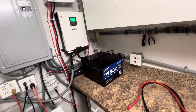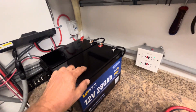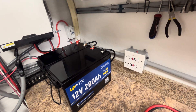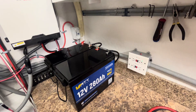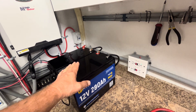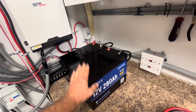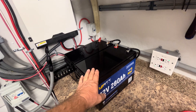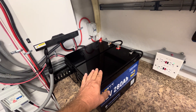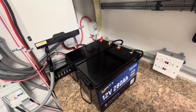You could definitely use this setup. I would go with a native 24-volt battery — these WattCycle units are 3,584 watts each, so nearly 7.2 kilowatts of battery storage total. I'd recommend at least a 7-kilowatt battery. You might be able to go as low as 6, but you're really pushing it with the 20% cutoff threshold.